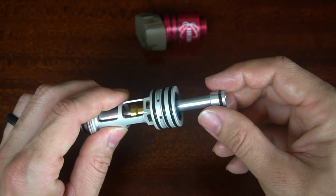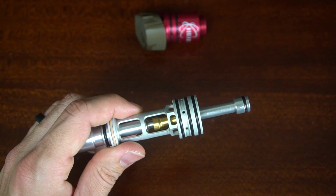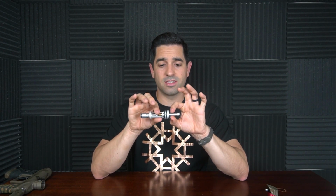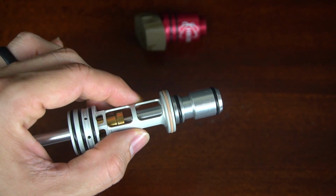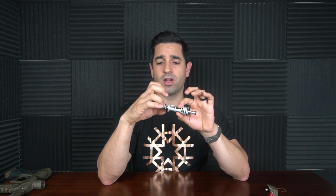Take a look at the rest of the nucleus core. You're gonna look at the bolt. There are multiple O-rings all over this thing, but there are only a few that you really have to deal with. On the back of the stem, you're gonna put a little bit of lube on there. Then you're gonna put lube on the end of it itself. Then you're gonna put lube on the 3 black static O-rings. You're gonna put lube on the tan static O-ring, and you're gonna put a little bit of lube, because you don't wanna put too much lube, on the front of the bolt.